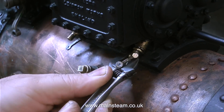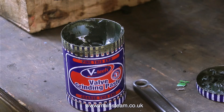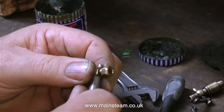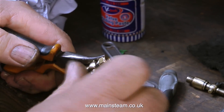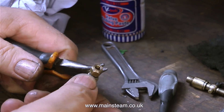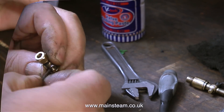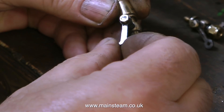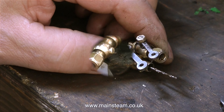One alternative way of fitting a drain cock is not a very good way because you can distort the body and then it leaks. I had a look in detail at this particular drain cock and there was a problem: the moving part and the stationary part were quite badly scored. By using some grinding paste and rotating the part with a box key, the parts were lapped together. It was while doing this job that I realised there wasn't actually a hole through the centre part of this valve at all — so it was a non-drain cock. I reassembled the valve anyway, set it to exactly the same angle as the other valve when open, then held it in the drilling machine's vise by the quarter-by-40 nut and drilled a hole through the barrel. Now as you can see there's a hole all the way through.